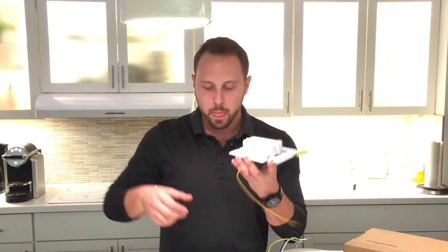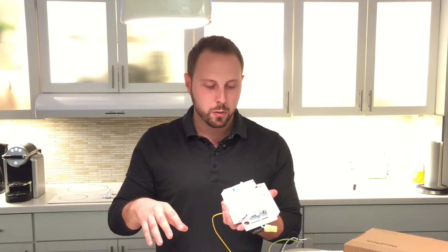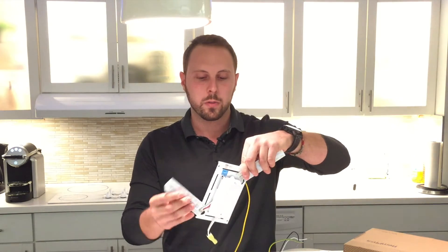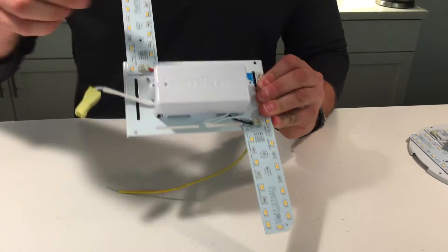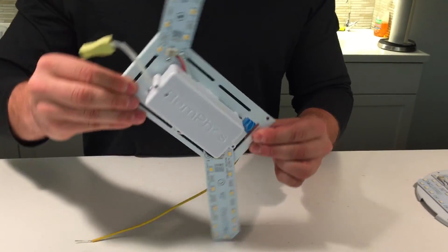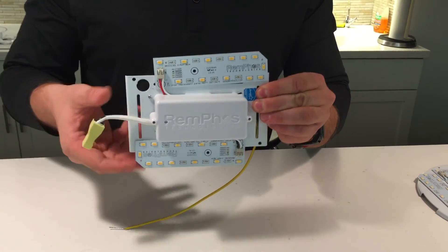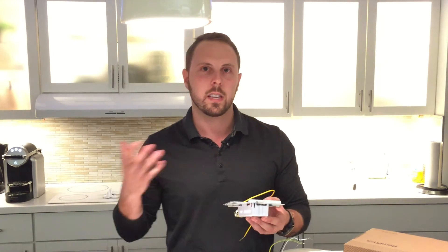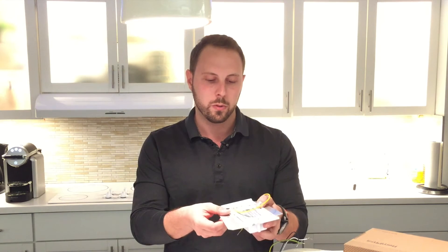Following that same line, this is our LED SR kit, which stands for LED sconce retrofit. It has similar features where we have boards on this unit that can swing out, pivot, and rotate — you can move them around to different mounting positions. This is important because there are lots of sconces out there with many different shapes and sizes and profiles, so this can fit tall skinny sconces, box-shaped sconces, half moon shaped sconces — a lot of flexibility. It mounts to the existing fixture pan once you've removed the existing CFL lamps, PL lamps, or whatever may be there.